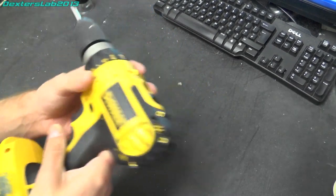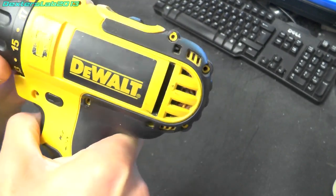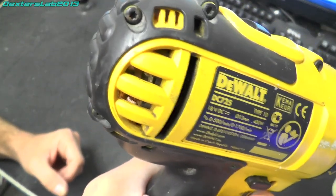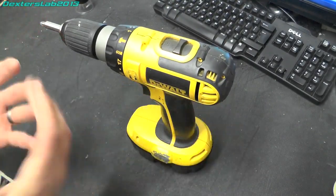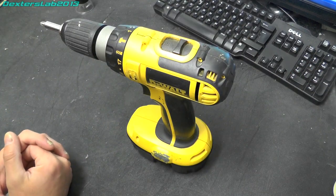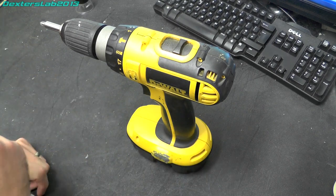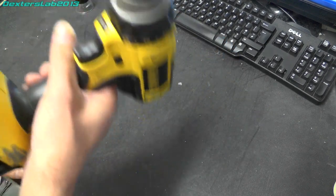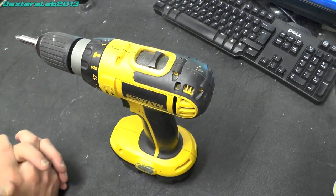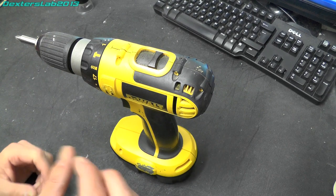Hopefully I should be able to demonstrate what the issue is. If you just watch in here where the motor is when I run it — those pixels are getting angry in there and the drill doesn't do much chooching. I think what has happened is either the brushes are completely worn out, or it's just really gummed up with lots of crap which gets sucked in there when you're using it, especially if you're drilling upside down. It sucks in all the debris, gets mixed in with all the graphite dust, and that's going to burn out your commutator really quickly.